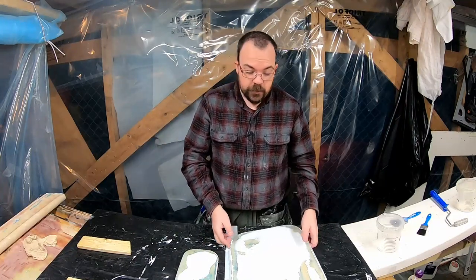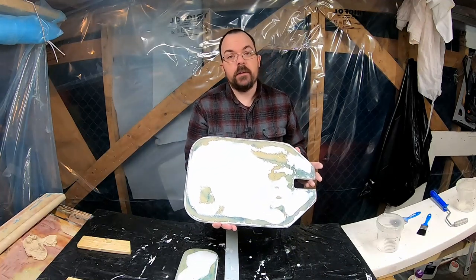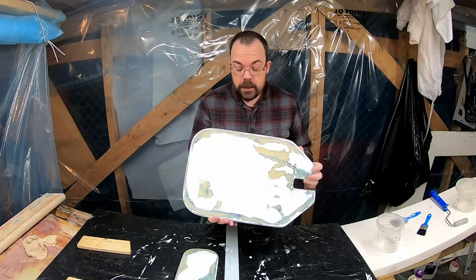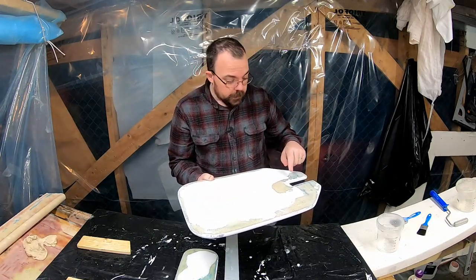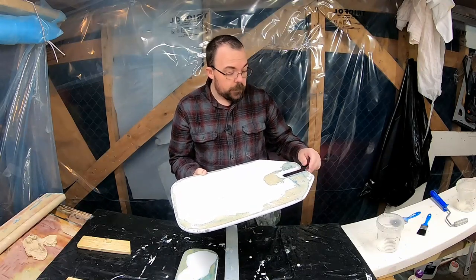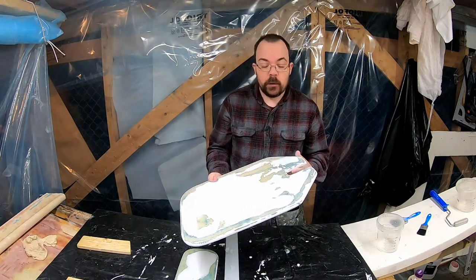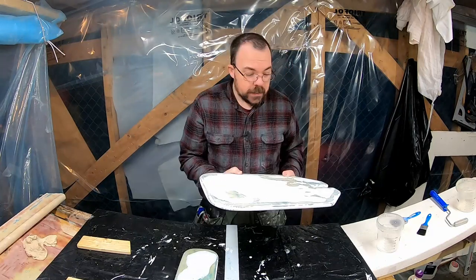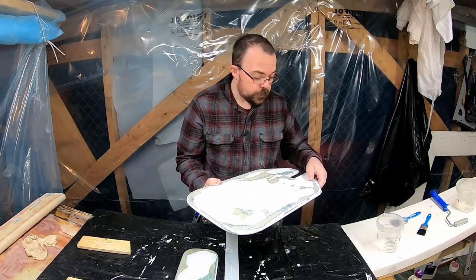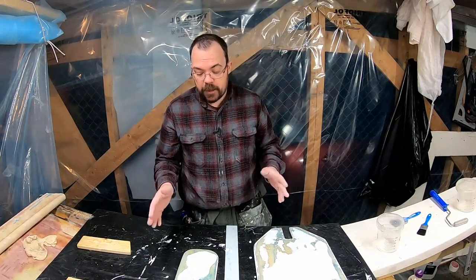So then the sanding of the shelves is done for now. This is the result. This is how it looks after sanding down all that gel coat or top coat that I applied. There's still some dimples and air pocket holes and stuff that needs to be taken care of. At some places here and there, I will put on some more top coat, like on these edges. That can actually wait for now. It's not necessary to do that before I'm doing the assembly.